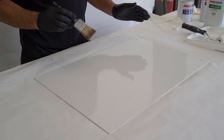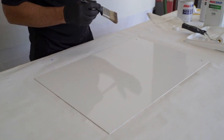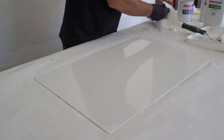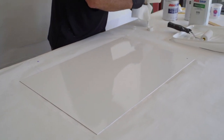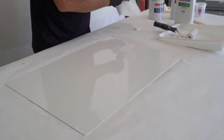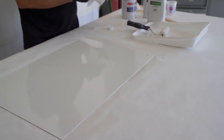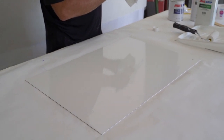This is only the first coat, so we're not super concerned about little dust niblets. You definitely want to be in a very clean environment for your final coat. It's going to take a good two to three coats to get hide on this, and you're going to have to wait overnight. You can't brush-apply two or three coats in one day. It's got to be fully dried, usually the next day, just a light sand, and then you're good to go with your next coat.